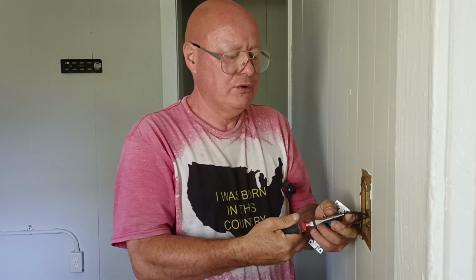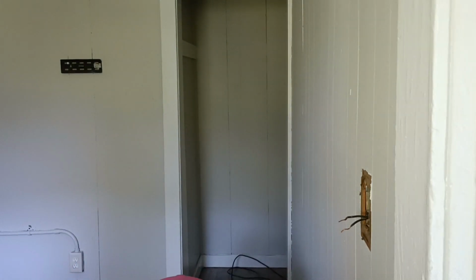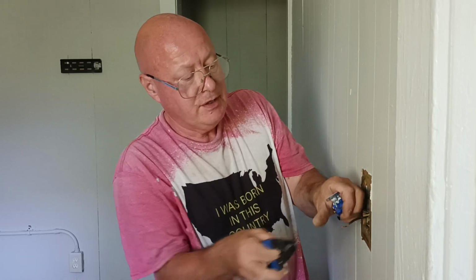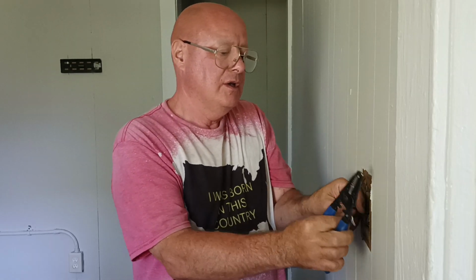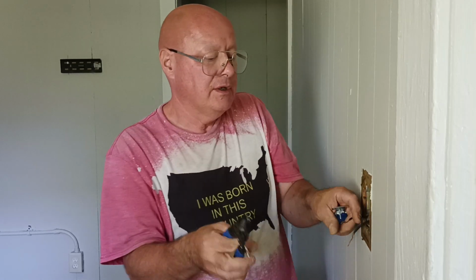And the way to use a three-way switch for a single-pole switch safely and according to code. They stripped these wires. They left a lot of insulation hanging on there. See how all the insulation is hanging off of that? You don't want to get that under your screw head. So I'm going to just take a slight bit more off like that.